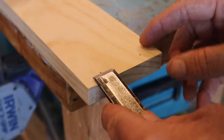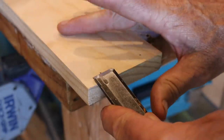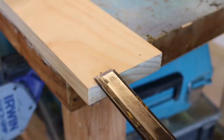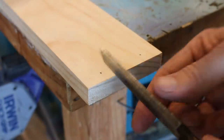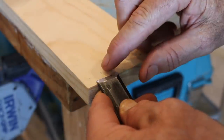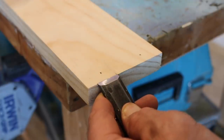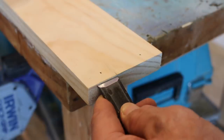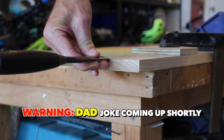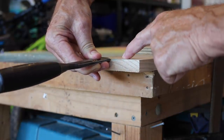Okay folks, listen up. The first thing is to make sure that the piece you're working on is clamped down nice and tight, because you don't want that moving around. Then, with the flat side of your chisel facing down, line the centre of the chisel up with your screw hole, and from the top of the wood come down between one and two millimetres — which is not very far at all. Then gently but firmly, while holding your chisel level, start chiselling a thin strip of wood without breaking it off.